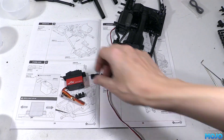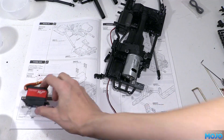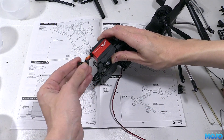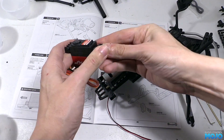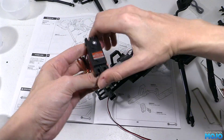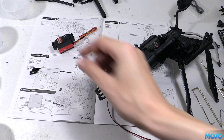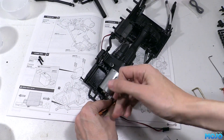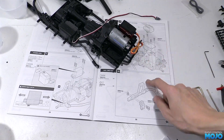The manual shows that we need the top of the splines to be three or four millimeters from the bottom of the electronics tray. This will be based on the plastic servo arm we're going to fit later. If we change to a metal arm there's a good chance we'll have to fiddle with the mounting. To fit the servo to the tray we need four M3 by 15 cap heads — one screw per corner. Do them up so the servo is nice and solid on the tray.